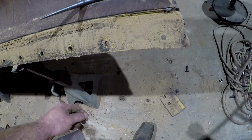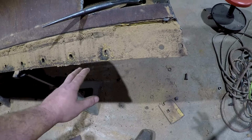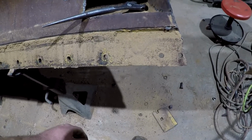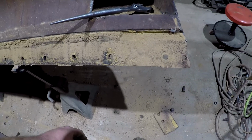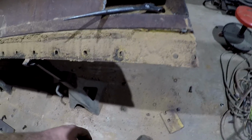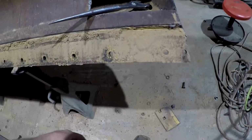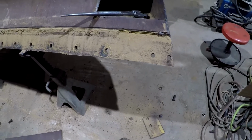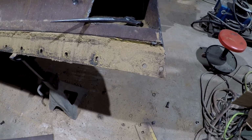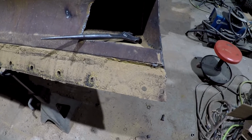When I was working in a fabrication shop for a short period of time, I would get between 500 and 600 holes generally out of one of those cutters in like 3/8 steel. We had a bunch of flanges that we would do that were just bolted flanges, stuff bolted together, and they were 3/8 steel. Of course, the thicker the steel, the less number of holes you're going to get. Those things are resharpenable, but you have to send them off when they start getting dull. We usually just ran them until they broke. It's like $50 for one of those cutters.